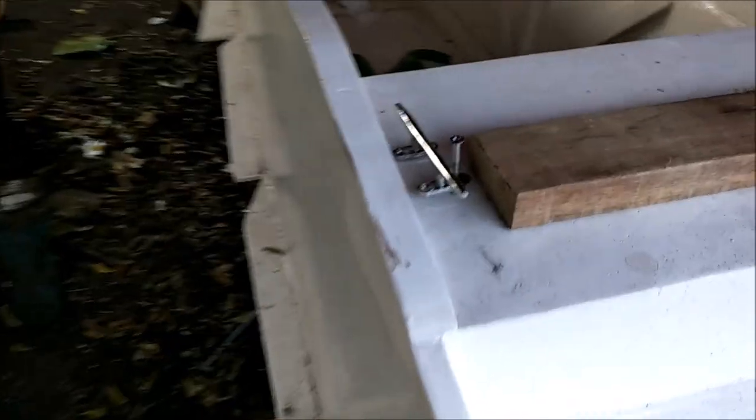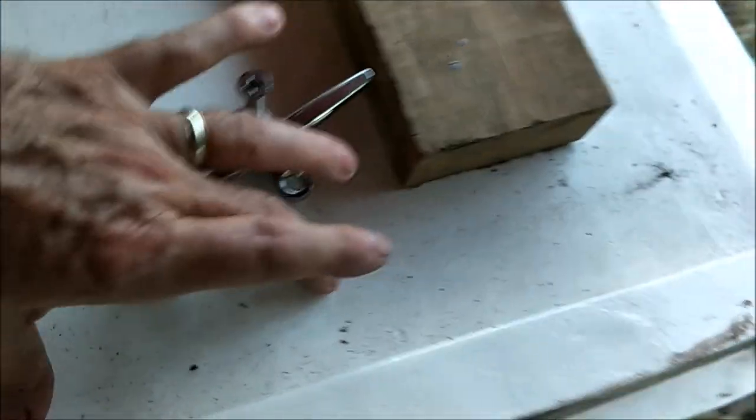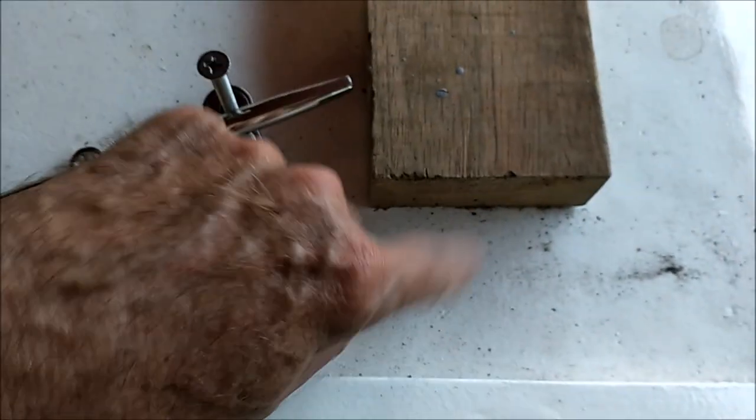We've solved the cleat issue. Alrighty. Yeah, because right here, well, let me see, have we solved it? Yeah, I've got enough distance between here and here. This is a 2x4 thickness here, and then this is three 2x4s here. So between here and here, I can mount that cleat. I can drill down through here. This is 2x4, so it ain't going nowhere. It ain't going to rip out, and I'll have one on each side. Like I said, that will also help with the ladder rope.